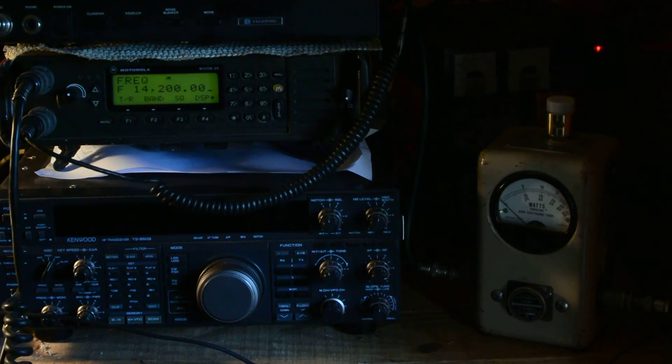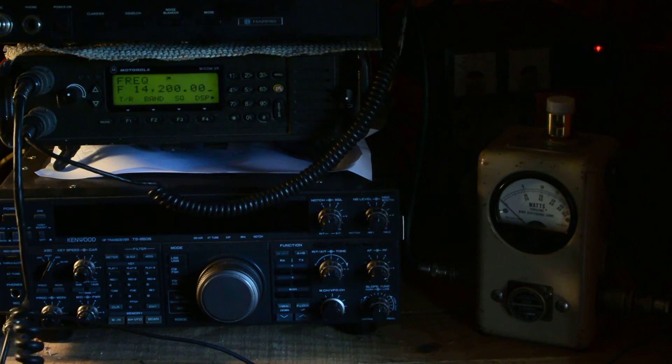We're back on the frequency I had set before. I hope I showed briefly what this radio is all about. I like them because they're fairly simple to use and certainly reliable. I use them for Pactor — I connect a Pactor modem to the back 44-pin connector, and then I can use the radio for doing WinLink emails. I've done RTTY but never tried other digital modes, though it's all possible by connecting in the back and making cables to adapt to your modem or TNCs. So that's about it.